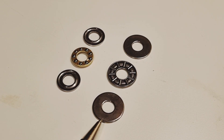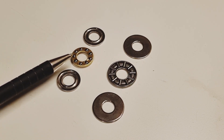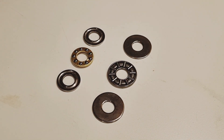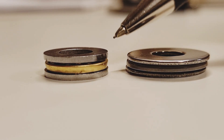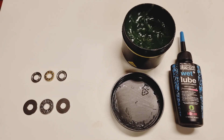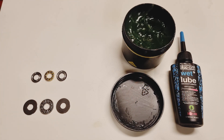How does the needle type compare with the ball bearing type? I started out with the ball type just to test the concept and used them for several years on my drill press table and router table without any visible damage, but I think I'm switching to the needle type — they have a higher load rating and bigger washers to distribute the force. One advantage of the ball type is that the stacking height is slightly lower than the needle type. Price-wise they are about the same. I use these bearings dry without any grease or oil — that may increase friction a little and reduce lifetime, but there is not much spinning involved. Using oil or grease in an open bearing in a wood shop with sawdust would most likely make them cloggy and sticky after a while.